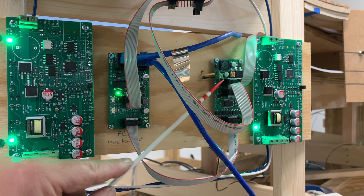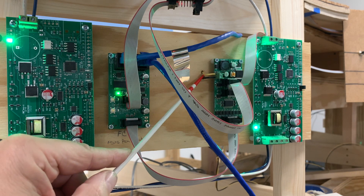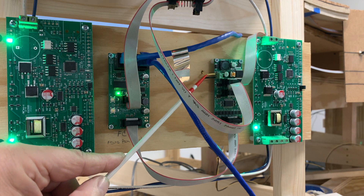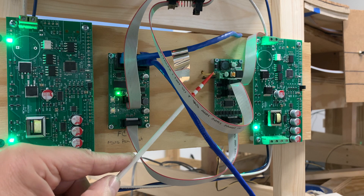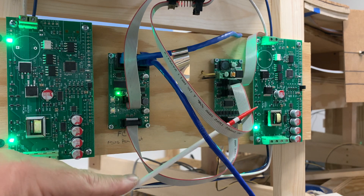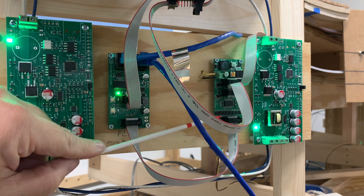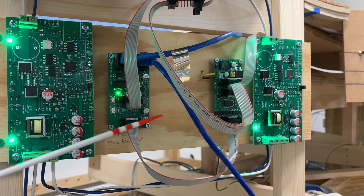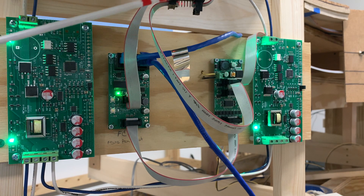The way the stall motor driver works is you've got power coming in — I want to say I'm supplying 15 volts and it's a one-amp plug — and then that gets metered out in the stall motor driver. When it leaves through the ribbon cables, you've got the first four and then the next four, and you can handle eight Tortoises with this. It carries the power on the ribbon cable and it also carries the input/output coming in from the LCC to the Tortoise adapter board.